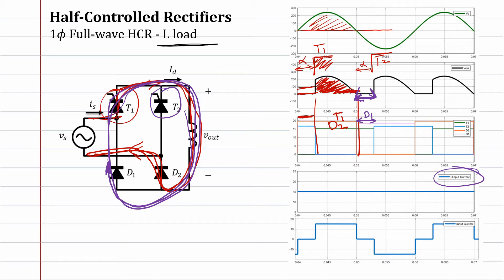At this point, diode one and thyristor one are conducting but the output voltage is zero — yet there is current flowing. This is a very important point and it's different from the previous case. If you remember, with thyristors the output voltage became negative, but now the output voltage is zero — no problem. We get a rectified voltage at the end. The output current is always positive.